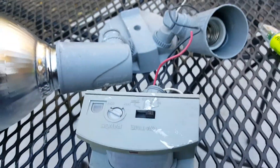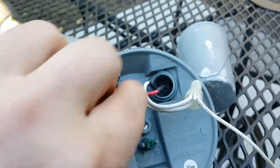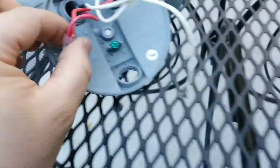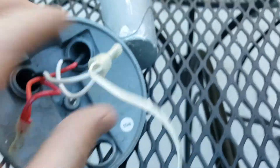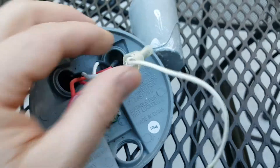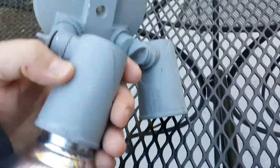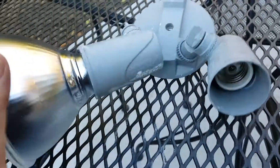Okay, so moving on — I've already removed the light. You know, your obvious red and black wires here, although in this one your hot is red and white. Usually the wires are white and black like this, but this one has red for the hot and white for the neutral. So these had a third lead that went into this, and basically what I did was I just cut these off. So what we're going to do is cut off these caps and tie those together, and then just plug in the red wire into the black wire of my house and the white wire into the white wire of my house and then hook up the ground. Your green screw is your ground. So that'll just make this into a regular floodlight and that way I don't have to go buy a new one, which will be great.